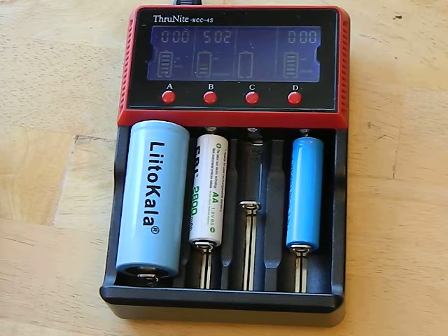I've used this thing and charged probably 20 batteries on it because I've been doing a lot of flashlight runtime testing for my forum work. This thing charges very accurately to 4.20 volts — occasionally you'll get one that goes to 4.21, but that's no big deal as long as it's within 0.05 volts, which is the expected accuracy. No issues with overcharging. I've left these in overnight just to see, and no issues — no batteries draining either. Some cheaper chargers, after a battery fills up, will start to drain it back down.